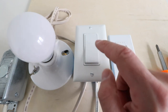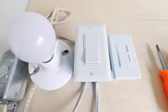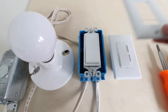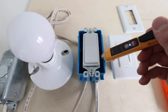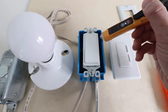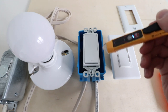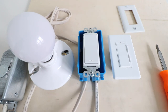We turned off the power at the circuit breaker and you can see that this light switch no longer operates, which means we have cut power off. Now we're going to remove the two screws on the cover plate. With the cover plate off, we can use a non-contact voltage meter just to confirm the power is off as an added measure of safety. We're getting a negative reading — no sound and no lights — which means there is no power. You always want to be safe when working with electrical.